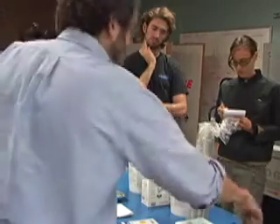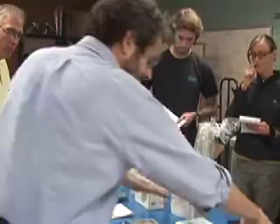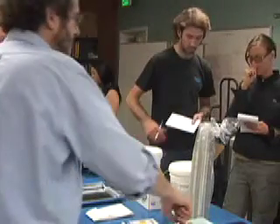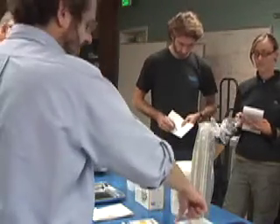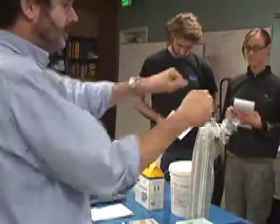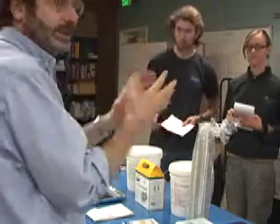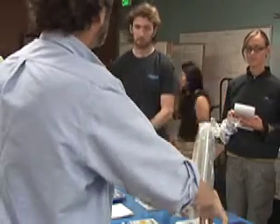So the steps are: we machine in the machinable wax, then this is a urethane rubber, this is a low temperature wax — it melts just above room temperature. You can soften this in the toaster oven, and then you can mold it by hand, or you can wrap it, make an impression. So you can use this to sculpt the mold.